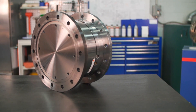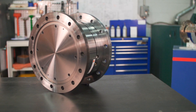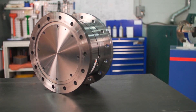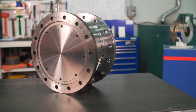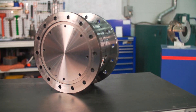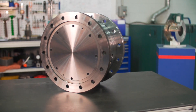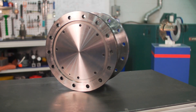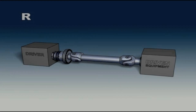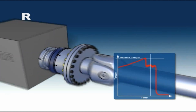The safe set is a hydraulic torque-limited coupling that transmits torque through friction. The hydraulic pressure in the coupling is adjustable, allowing for a variation of the release torque. This ensures a precise release point, resulting in the maximum possible catastrophic overload protection of the mechanical driveline. The following instructional video will review the operation and usage of the safe set. When the release torque is reached, the coupling will slip, shearing the shear tubes and releasing the hydraulic pressure within the coupling.